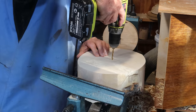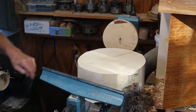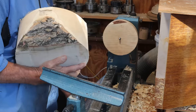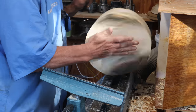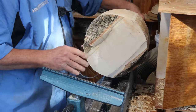A little hole up the middle, more or less at right angles, and this is going onto a number 14 wood screw. Plenty of friction on the back should hold it fairly well. Run the lathe at about 100 rpm, feed it on, then lock the spindle and just cinch it up.